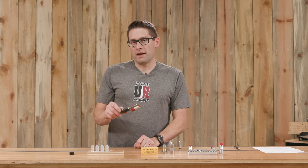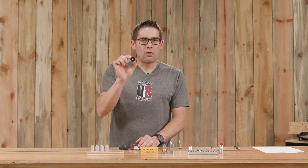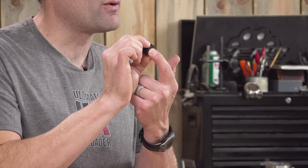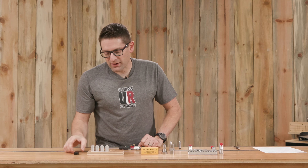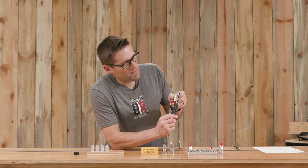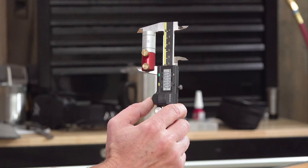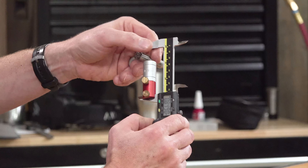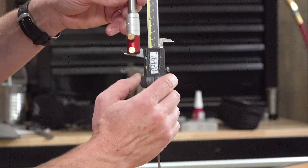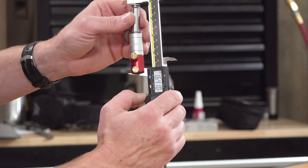This is the only tool I'm going to show you that will give you an absolute value. Hypothetically, we could do that with a metal or plastic donut bushing that had the correct diameter — if I bored this out to 420, this would be a decent absolute headspace comparator. I'm going to put the jaw against the edge of the tool and zero it out. Now if we take our go gauge, this should be pretty close to that reference diameter we see on the SAAMI chart. It says 1.641 inches.